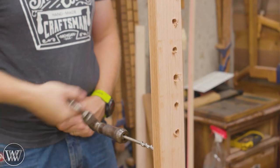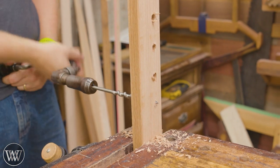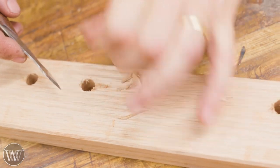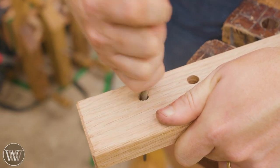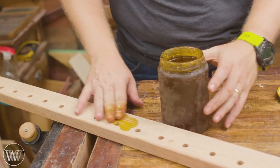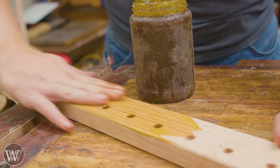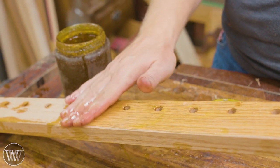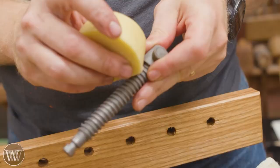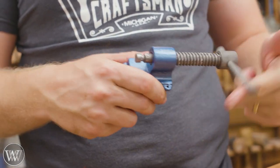I didn't flip the board around to do clean exits — it's just faster this way. I come back with a knife to clean off those splinters. It looks a bit rough but it's a clamp, and it's also good practice chamfering with a knife — you get practice going with the grain in each direction. The hole on the end doesn't need to move in and out; that one stays in place where the screw goes. For finish, it's boiled linseed oil and paste wax — what I put on all my hand tools. It feels great in the hand, it's not incredibly protective, but the look, color, and feel are very hard to match. Wipe in the boiled linseed oil, then hit it with paste wax and wax up the screws.